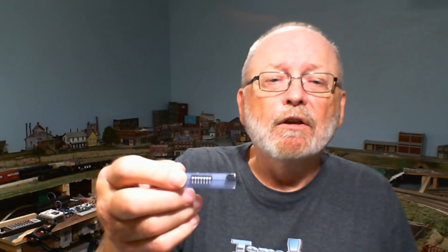It's a 14-pin IC, and we'll put this on the board and let you see what it's like. If you still need some extra space and want to program this, it's easily programmed from your Arduino. You could use an Arduino Uno — I'm going to show you how to do it on the Uno — but you could also do it on a Nano and a Pro Mini; it doesn't matter which one you use.